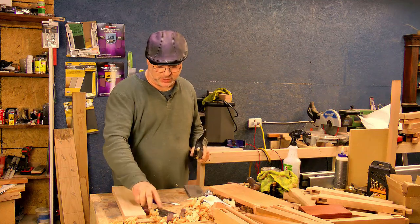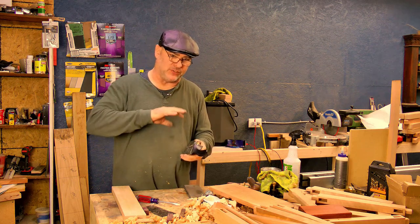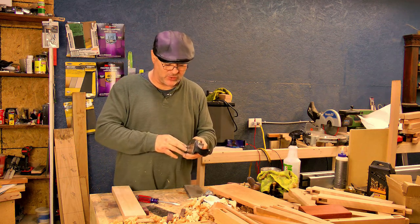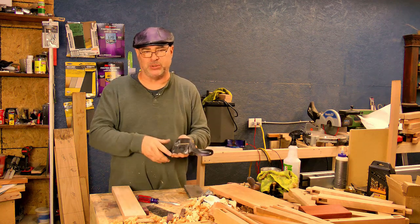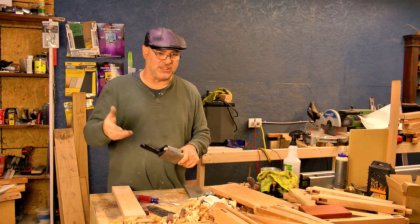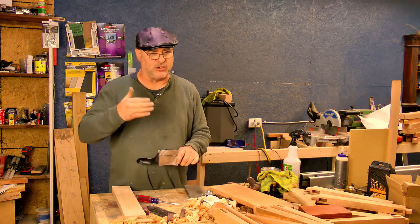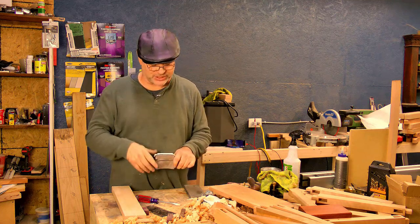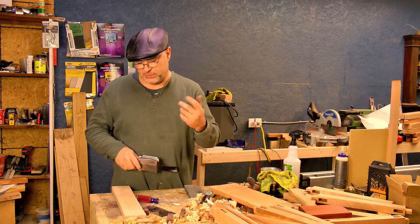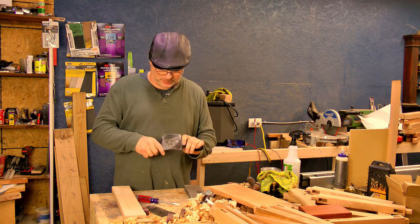This is one that you want to experiment with and find out what you can get out of it, like how to sharpen the blade. Like I said, I do 5 to 6 and then I round them over on each pass, so you might do it a little bit differently. Rounding over the corners is another thing I do, so that I don't gouge the wood with the corner in case you put it in crooked or something like that. Then you don't have to go back and try to fix some gouge that you created. If you happen to have it rounded over, all it's going to do is take off material on one side. You can readjust it and go back. Also, sometimes using a paper will add just that hair thickness that you need to be able to take the shavings off. How you use this really is going to be up to how you prefer to use it, but I do recommend having one.